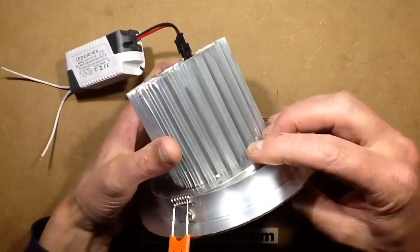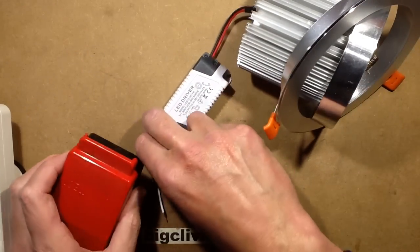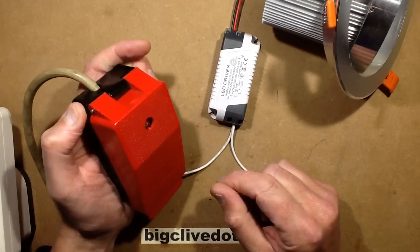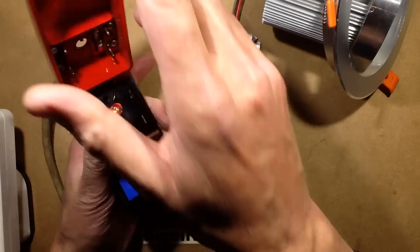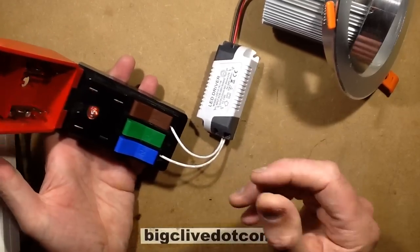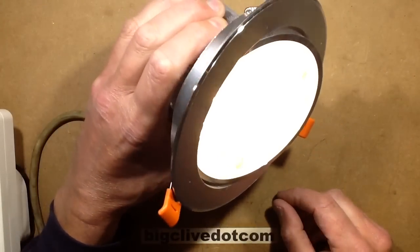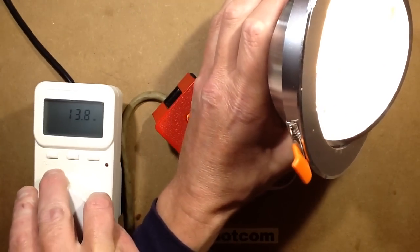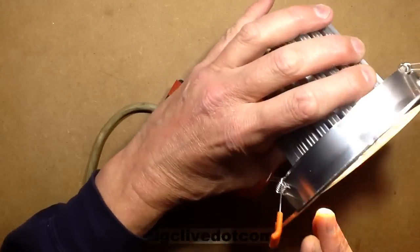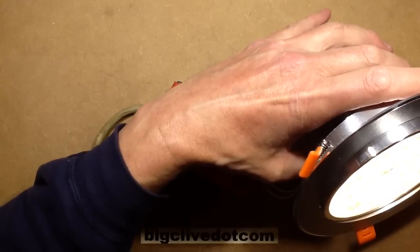But you know, that's fine — I do prefer to keep the power dissipation low. So let's bring in the power meter. I'll mention again the QuickTest — it's a device I believe made in or sold from the UK, it's a tester and I've got a video dedicated to it. It's a very convenient way of making an electrical connection at a bench. So that's it lit. Pick it up gingerly because you just don't know what's isolated and what's not these days. Power is 13.8 watts — so it's just under 15 watts for the fixture, just under 1 watt per LED.